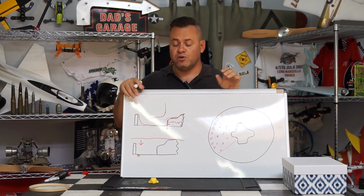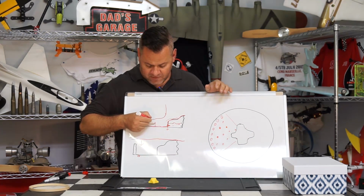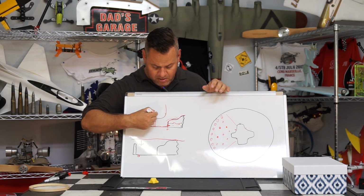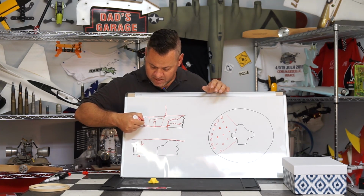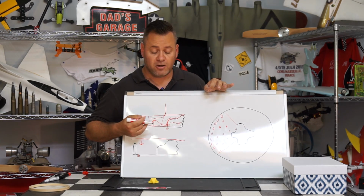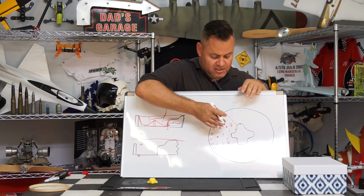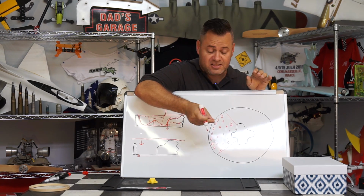Now another thing that you can do to draw the plastic out a little bit thinner is what we call vacuum pegs. Big commercial machines have these actual little dowels that you can put in, and so as the plastic comes and it's drawn down over it, it hits this, and so it creates a web. It'll come down, up like this, and then down like this, and that draws the plastic out even thinner. One other thing it's going to do also is prevent webbing. If you were able to create some dowels in these areas, it causes the plastic to stretch out instead of the extra material wicking and sucking together.